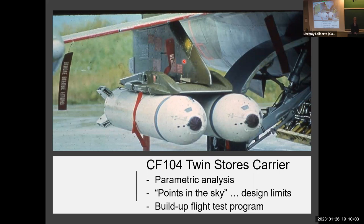In particular, there's an explosive bolt that attaches the pylon to the wing because the pylon is jettisable. And there are sway braces — this is what a sway brace looks like — that handle the lateral torques. What we needed to determine was how those loads varied with airspeed, Mach number, and angle of attack. We could put pressure gauges under the sway braces to measure force, but it's a redundant structure, so you couldn't actually resolve it completely.